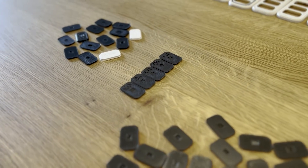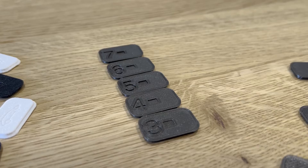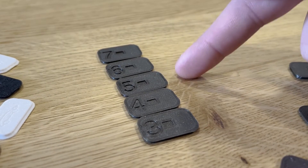So in order to get the satisfying click... I did open my car. This thing's got pretty good range. When I'm talking about button feel, it's really broken up into two categories. There's the button itself - how deep the hole is, where the button head fits into, the general texture on the top - and then what I'm calling the button spacer. This is a component that I designed that would basically distribute the pressure when you push the button down over the entire area of the key. It just gives you a better feel and makes it so that you're not getting weird behaviors in the corners of the button. To actually decide on a button, I had to go through a whole bunch of trials, varying the different heights of the button inserts - 0.3 millimeters, 0.4, 0.5, 0.6, and so on - all of these just to get exactly the right feel. In the end, I think I got through like 11 different versions of the spacer and God knows how many buttons.